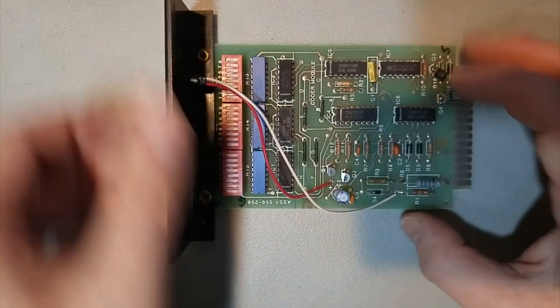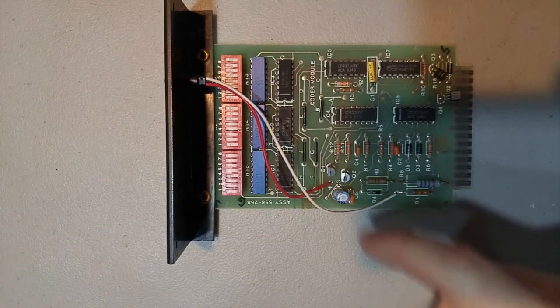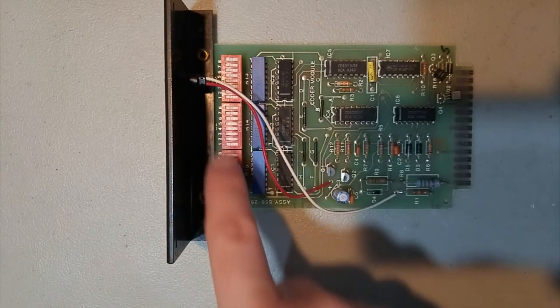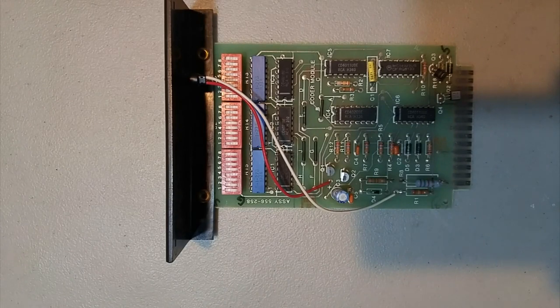Other cards I've got here is the fairly complicated coder card, which does a coded signaling pattern. And I'm not 100% sure how these things work, but it is all based on logic. There's no microcontrollers at all. These switches control what the pulsing pattern is. And there is a timer in here, which only allows it to run four times.